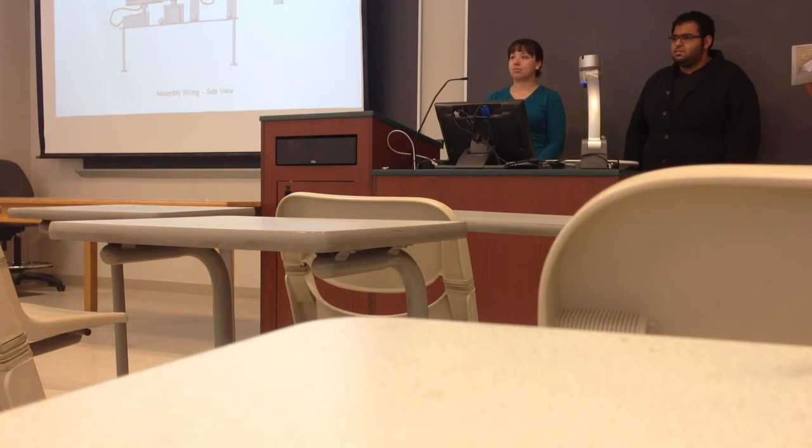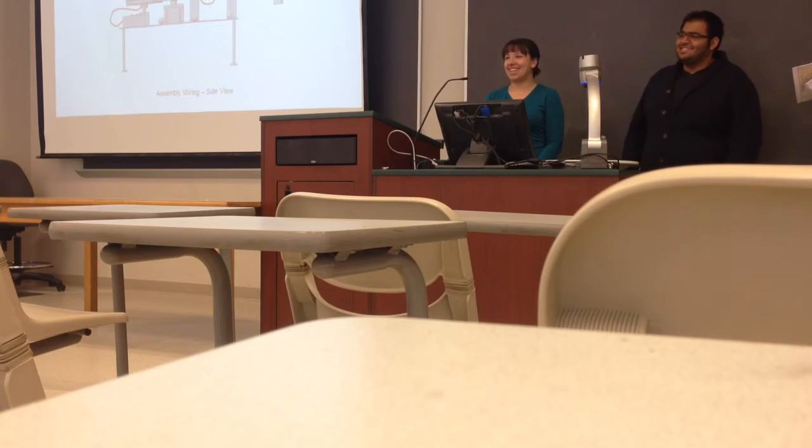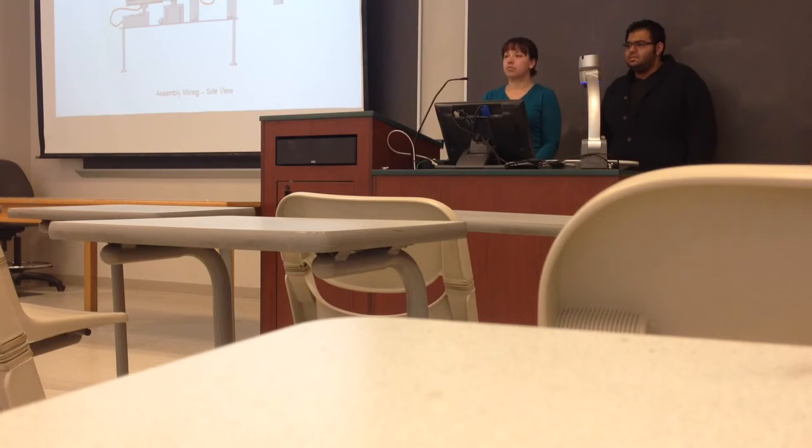Is that what you're expecting me to ask about? Something like that. Never done the torque on arm one question. Now, why don't you take that one? Good. Okay, so let's say arm one, we'll put everything in the vertical here so you can see what I'm doing. This is arm one, this is arm two at 90 degrees to arm one, here's your gripping mechanism, right? If I have a force out here, both from self-loading and let's say the magnet force, it causes a moment about arm one, like this, right?